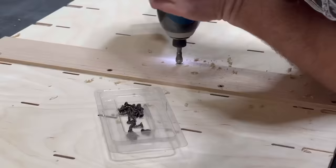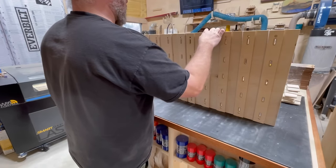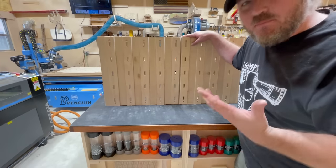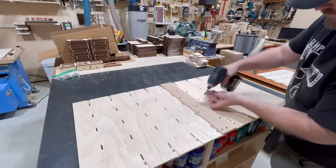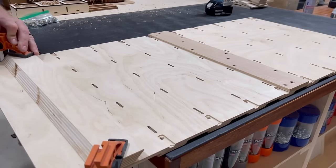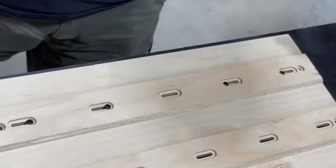I've been doing this a long time with French cleats, and you'd think I wouldn't make such a bonehead mistake — the cleats are facing the opposite direction. Just absent-mindedness, but easy fix. I'm really glad I didn't put any glue on that second panel. We're going to take one of the French cleats we've cut down, put it on the back of these panels, and screw it in using those pre-drilled holes. They're spaced every four inches for studs, which also conveniently works for attaching the cleat.